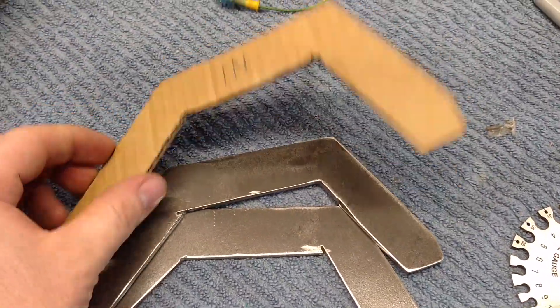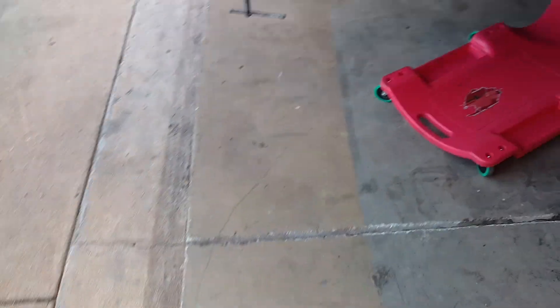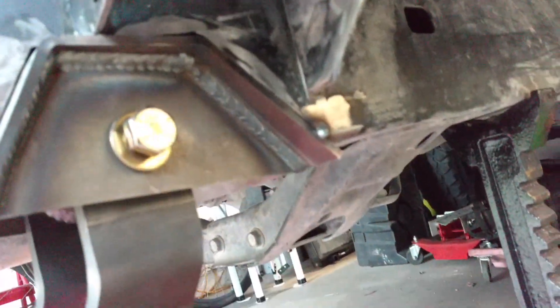I made these two plates from a template — I'm going to show you what they're for. The outside welding is going to be fine, and it's going to be fine on the bottom along there. But the back side I'm just being cautious. I'll grind some more out until it fits nice. This plate is going to give me a little bit thicker weld across here, and then I can weld along the boundary of it as well — just kind of spread the load out from this joint.